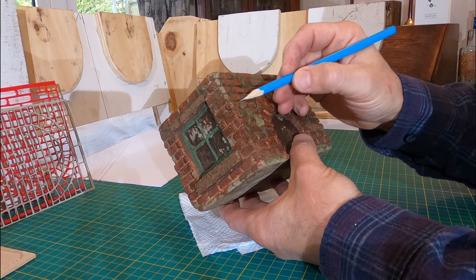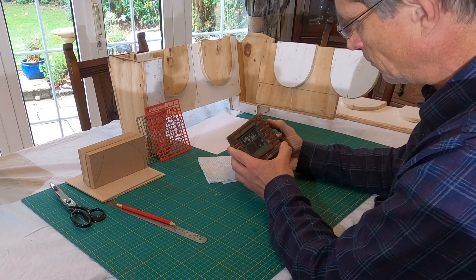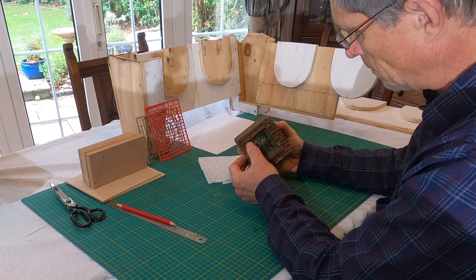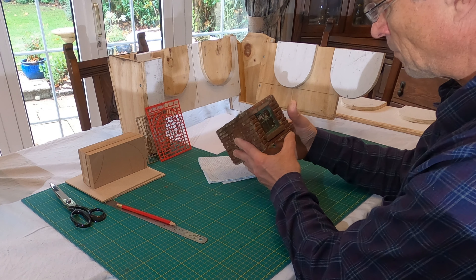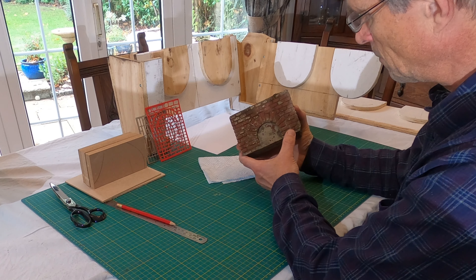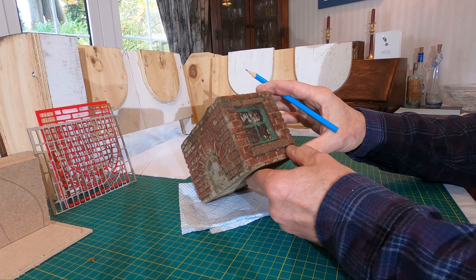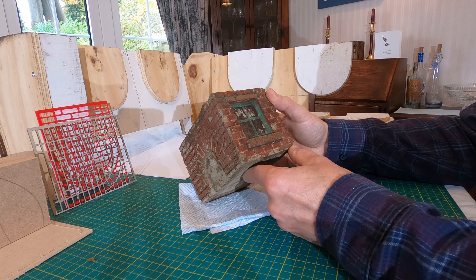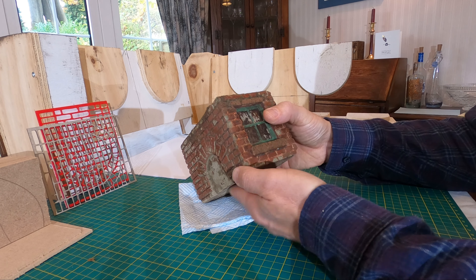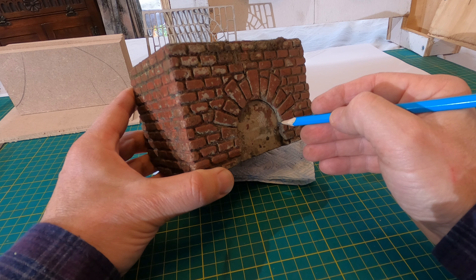I have considered some ways to create the stone shapes onto the concrete structures. About six years ago I did a trial of a cast cube of concrete to include some stone or brick courses, an arch and a window. This little block of concrete has been left outside for six years and the surface features with the acrylic paint has stood up very well to the English weather. I plan to do the same technique to create a stone block effect on the bridge and embankment walling.